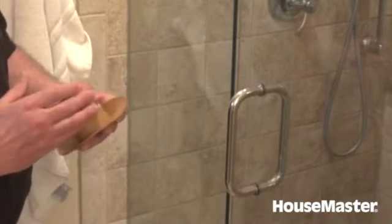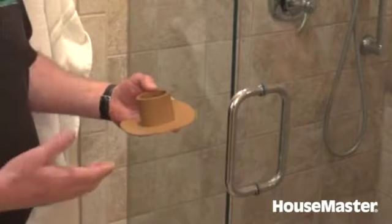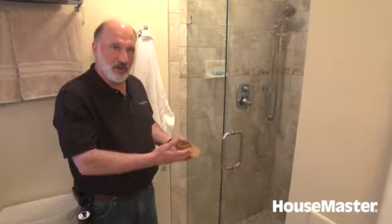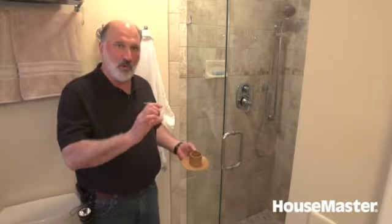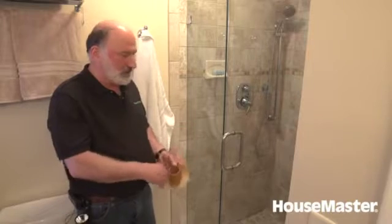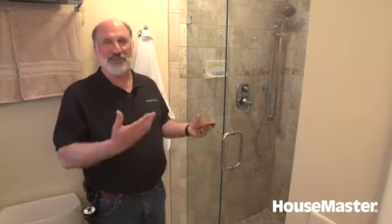This shower has a tile floor, and when you have a tile floor you're going to have a shower pan. You can't see the shower pan — it's actually below the tile and should extend up along the wall. We have a device we can place over the drain, then turn on the shower and let it run. The device dams up the water and allows it to come up to an acceptable height that the shower pan should hold without leaking. You put it on, fill it up, let the water run, and then go below to check for any stains on the ceiling.